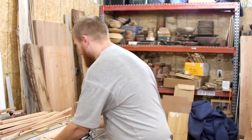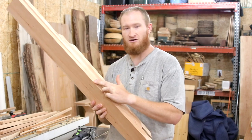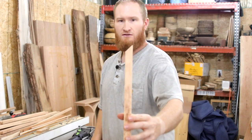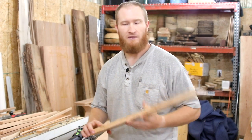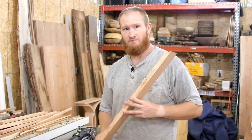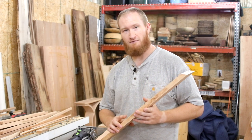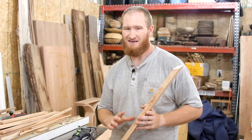What I have is 4 pieces, 2 pieces for the long side, 2 pieces for the short side. And how did I secure all those together? Well, what I did is I used the good, well-known miter joint. Just a 45-degree angle. And just a tip about that, if you're cutting miter joints and you want them to look tight and solid, cut it about 45 1/4 degrees. That's going to make sure that all those corners tuck together. Sometimes when it's a perfect 45, there's not enough wiggle room and you end up having joints that are open on the very end. And that doesn't look very good.